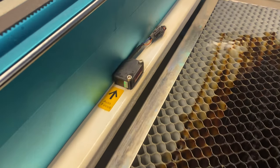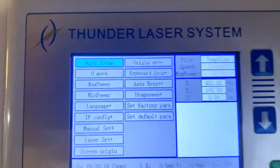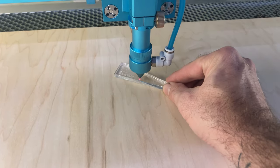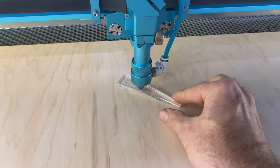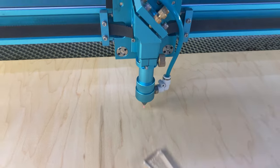Focusing this machine is a breeze — it's got auto focus which works really well if your boards aren't warped. I tend to just manually focus it a lot as well. The ideal height for focus is 6mm, and Thunder actually provides you with a little tool that is 6mm deep, so I can just drop the head onto that and I've got a perfect focus every time. It's easy.